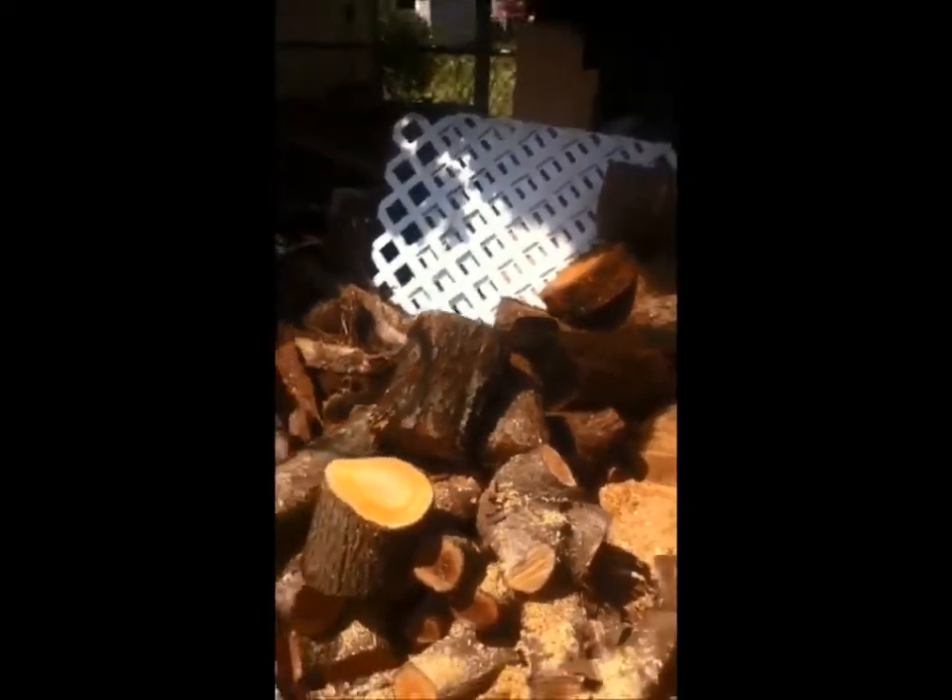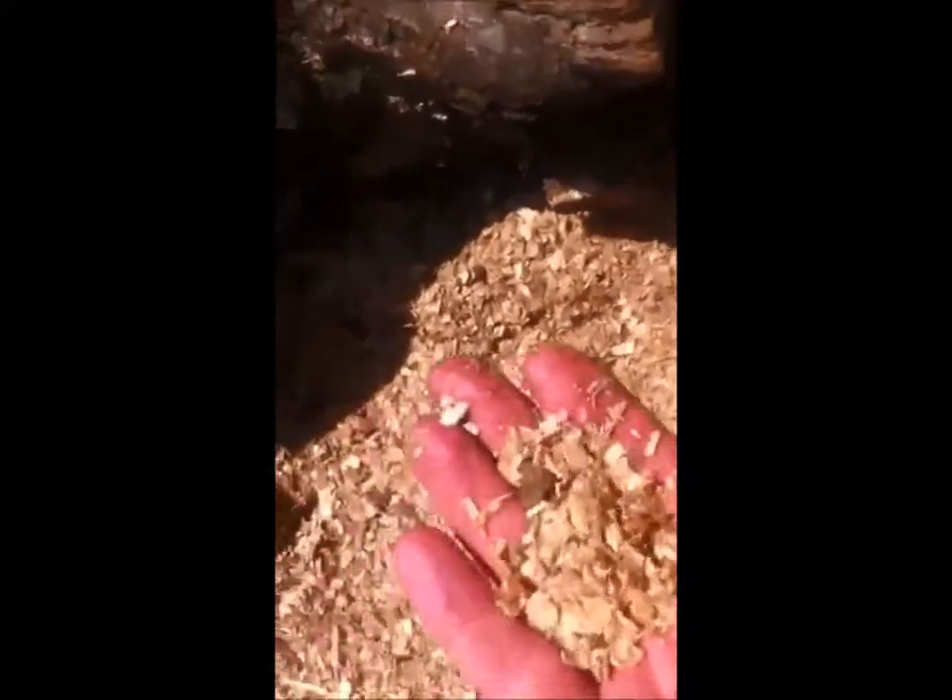A couple months later, it looks like my chain's not burned. I was using the vegetable oil and the chain is still nice and shiny. This was the pile I cut for my wood stove — it took me about 20 minutes. This is the sawdust; they recommend it be about a quarter inch to tell whether your chain is sharp, and this looks pretty close. I cut all of this wood with the same oil and used less than 8 ounces of vegetable oil.